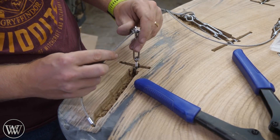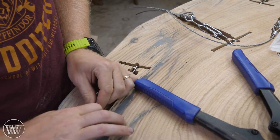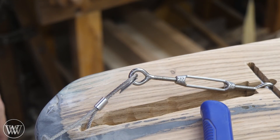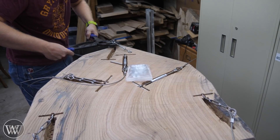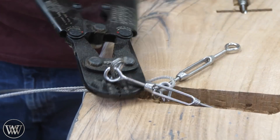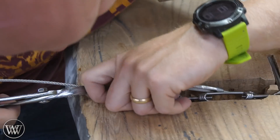This is where everything really comes together — it's starting to turn into a coffee table. We're going to put the sleeve through, then put it on the eye which is already around the turnbuckle, slide it back into the sleeve, and then crimp it down. I want to crimp them down as close as I possibly can, so it takes a bit of fiddling to get the eye in place, pull all the slack out of the cable, get them down close, and then press them down. I want to get that eye as close to the entrance as possible — the closer I can get, the more space I have to pull the turnbuckle, and the better the chance I'll actually get it tight enough.